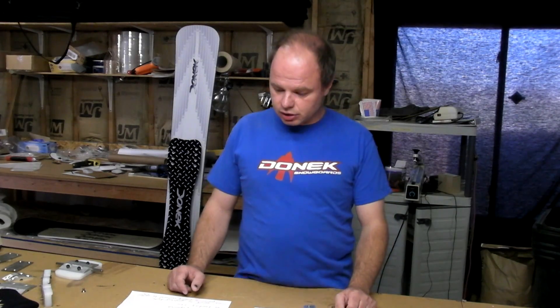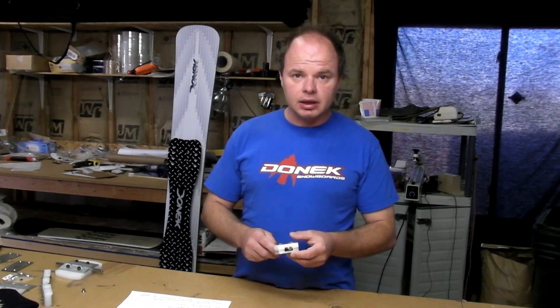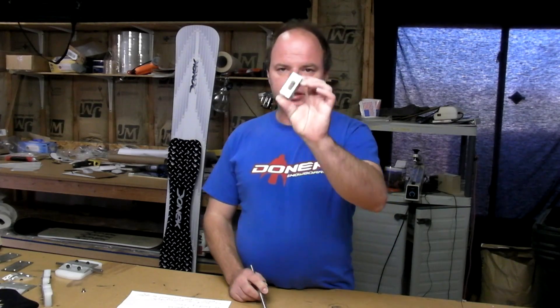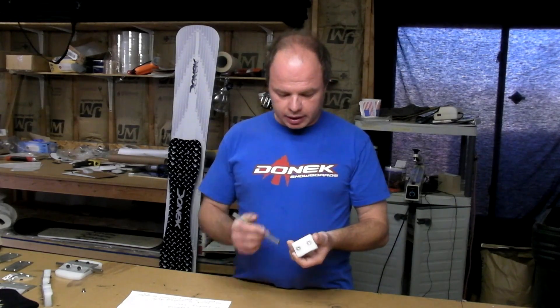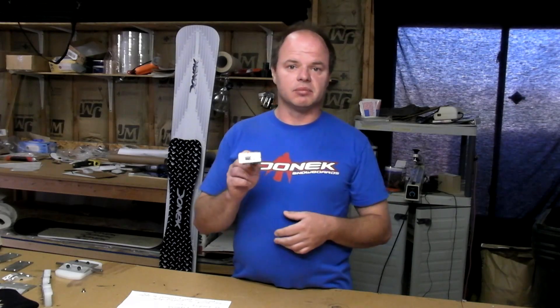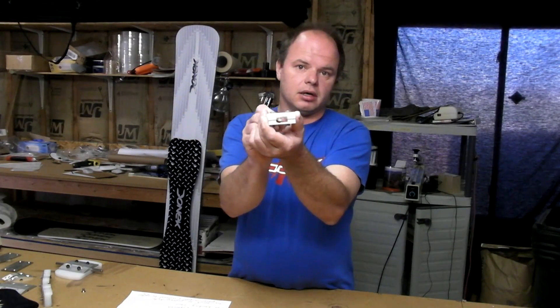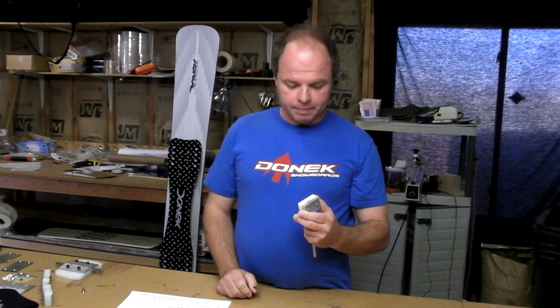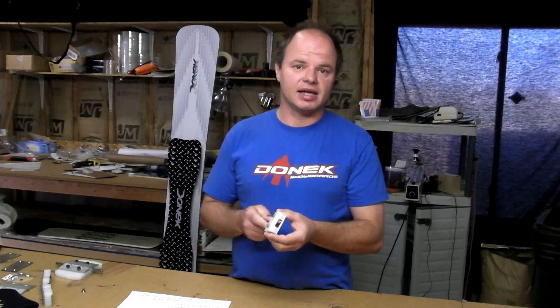We really don't want to see the board failing under those situations. That's why we're pushing the plate to these limits and trying to see where the failures occur. The first thing to talk about here is our slider mechanism. This particular slider that you saw in the video was sort of a new idea. It was never tested on snow, but it had a great appeal because of its simplicity. We basically had a shaft sliding in a rectangular trench. It's a very simple, very elegant solution, but it has significant problems.